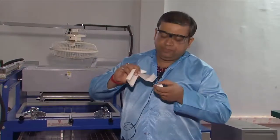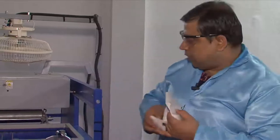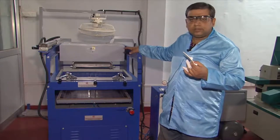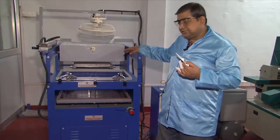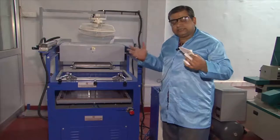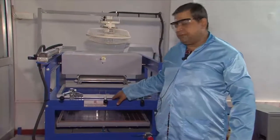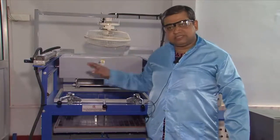This says a lot about the process capability of such a system. In a nutshell, vacuum forming, although used mainly for packaging, can also be used for creating micro devices and micro features. This is a very useful tool that provides amenable, disposable plastic systems which can handle micro flows within small domains. One more important point: once the sheet is heated and formed, if you have committed an error and want to reuse the sheet, there is an option — simply do not remove the sheet from the machine and heat the formed sheet again with the heaters.